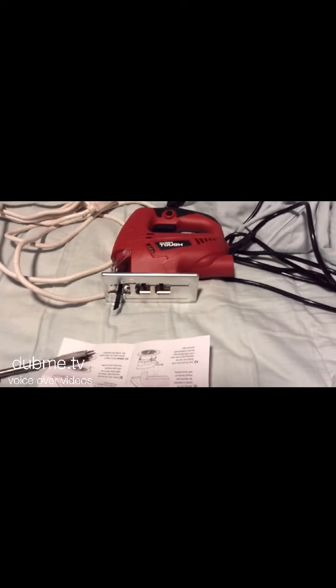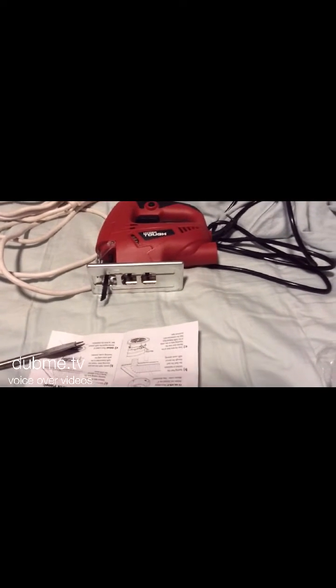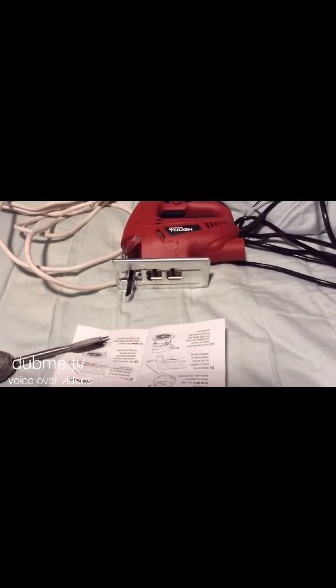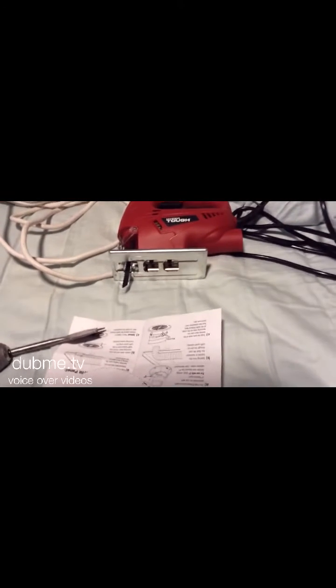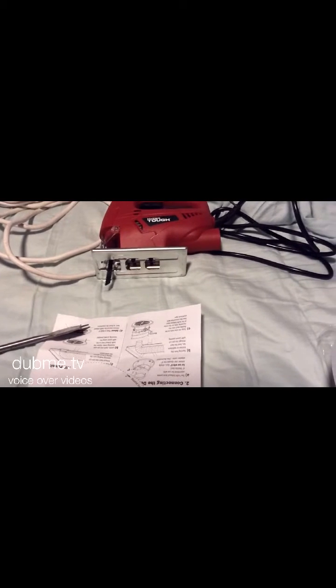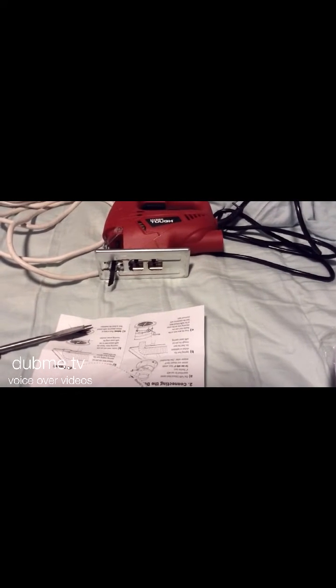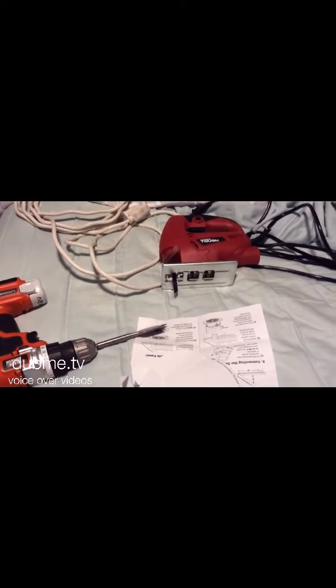The soffit cover comes with 3 Phillips screws to screw in the soffit cover once I'm done. And I'm going to use some clear silicone, put a bead around the outside of the soffit vent cover. And I use clear because once it dries, I can't see it. It's clear, so it's just going to look better aesthetically. So I need my vent hose and my soffit cover and some metallic AC vent tape. So that should be it.